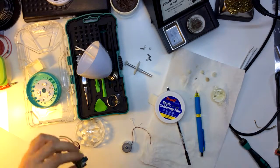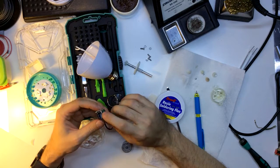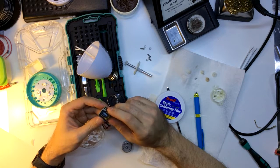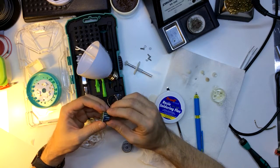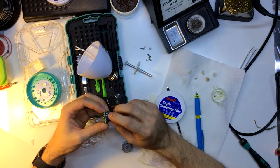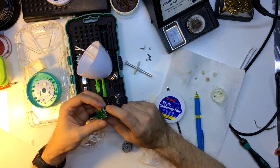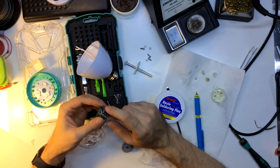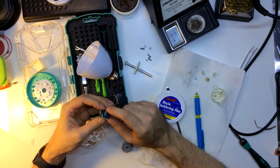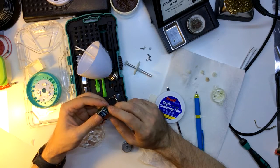and I have to say that I genuinely have absolutely no idea what's going on in this circuit. I'm fairly sure this is an inductor, and we've got the mains coming in and going into... this has to be an inductor because the color bands don't match any resistor color code I've ever seen, and I think that makes it a 2.9 microhenry inductor, the way those color bands are set up. My assumption would be that would be to potentially limit some inrush current, as the inductor has to build up its magnetic field before it starts passing current, potentially. No idea.